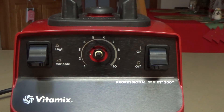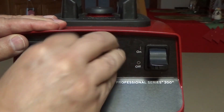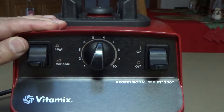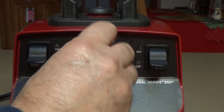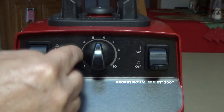Then you just turn the dial — you're working that lubricant in there on the rheostat. Let it sit for a little while, then you can plug it in and test it. Just work it back and forth; it'll eventually smooth out as you clean off the contacts on the rheostat.